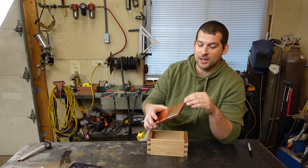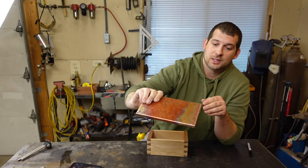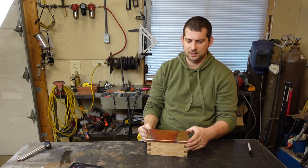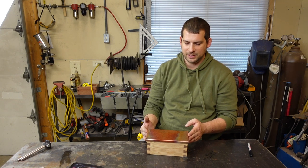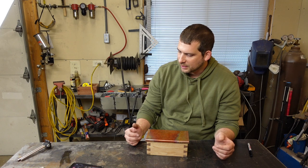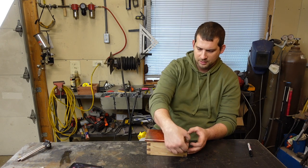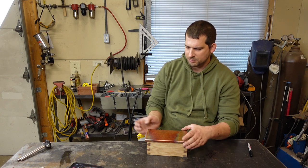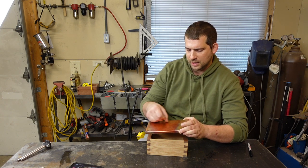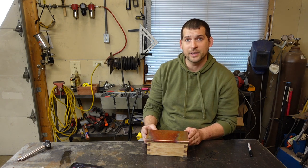So I've got a few problems here. Where I had to re-bend that, there is in fact a crack — you can probably see it right there. So I'm going to have to weld that and polish that too. But the other problem is it's pretty sloppy, a lot of movement here. I really kind of messed up there, but I do like the looks of it against the oak — I think it would look pretty cool. So the fix I've come up with is I'm going to notch the corners and bend these flanges back a little bit and add another brake a little bit in to get it to tighten up.